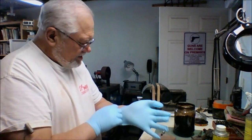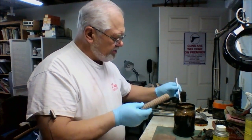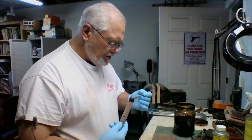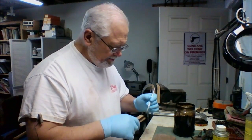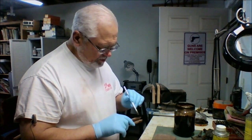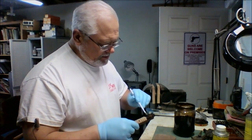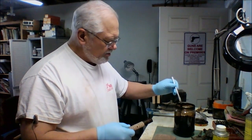This stain is pretty permanent — it wears off more than it washes off. Many instructions will tell you to take a damp cloth, damp the wood, let it dry, and that will raise the whiskers — that's good advice. In this case we're using a water-based stain, so I am applying water to the wood and it will raise the whiskers, which will be sanded off once the stain dries and it raises the grain.